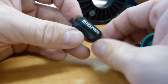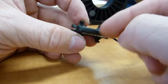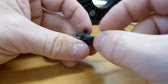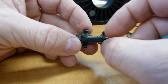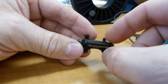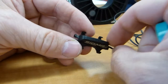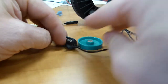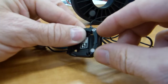There are no moving components inside the sensor — nothing else. The coil of wire is wound around nothing, sometimes air, but sometimes there is an iron core, such as a piece of nail in a very cheap sensor. That iron core amplifies or magnifies the signal strength and makes more of the electrons move along the wire.